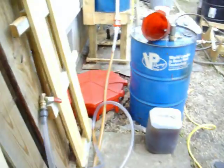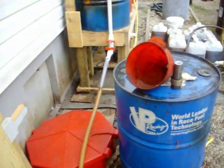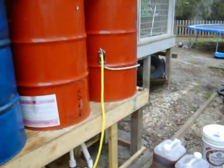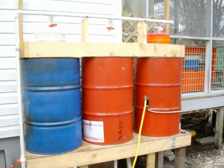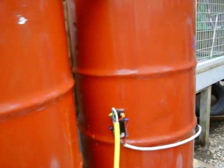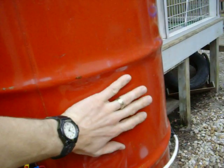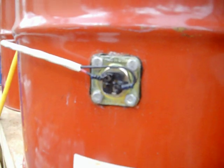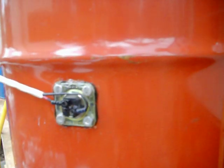Out of my centrifuge setup I've got another 220-volt outlet. That 220 runs into the backyard — I plug and unplug it as needed — and it comes out here to the settling station. I use that 220 to heat this drum, which is turned on right now and is pretty hot — it's a 5,500-watt element.